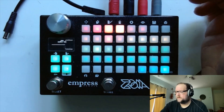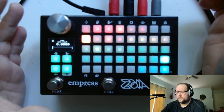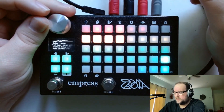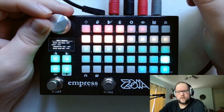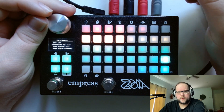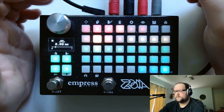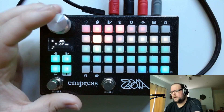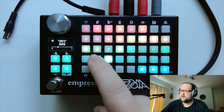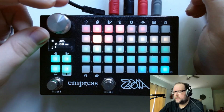That goes into a VCA, and then the envelope is quite important. What I have here is an ADSR with just the attack and decay stage set. In the settings, I've turned off sustain and release, and turned off immediate release, so this will act as a triggered envelope rather than a gated envelope. I find if you set the attack all the way to zero you still get the same sort of percussive sound, but it can be a little bit sharp.